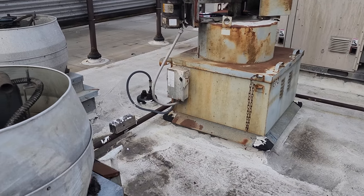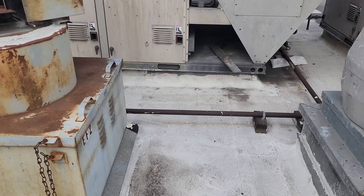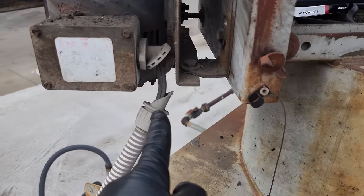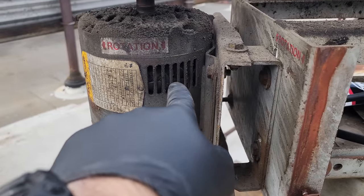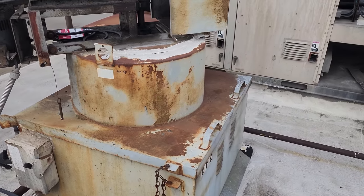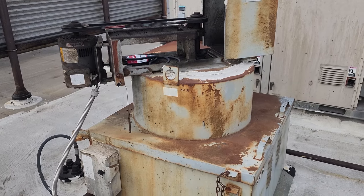Using the big picture approach with the customer's permission, you can find so much more. This customer doesn't do routine maintenance, so if I keep my eyes open I notice things: this conduit is plastic PVC, UV damaged, very rigid with no flexibility, and it's cracked. There are pieces of broken plastic in the motor, and the bearings on this unit don't sound good. The fan itself looks like a roofer put nuts on it for some reason — I'm going to talk to the customer about all the repairs this fan needs and give them an option of replacement.